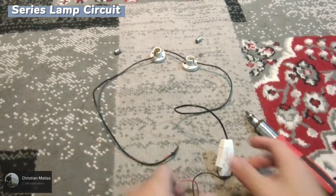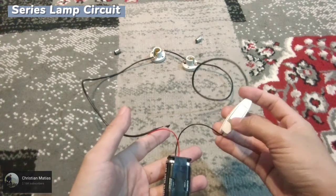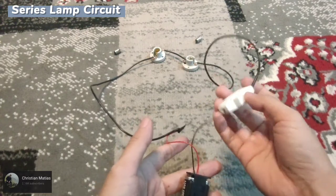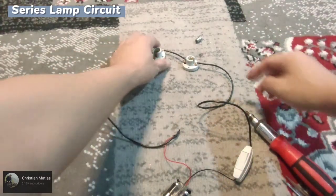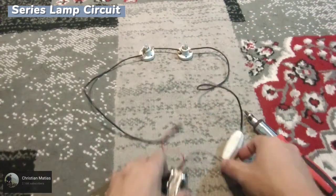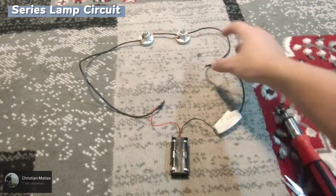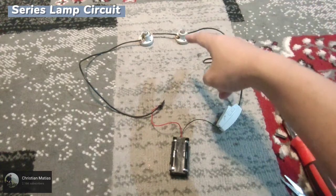All right, so we're done. It will restrict the flow of electrons when you press the off button, and it will allow the electrons to flow if you turn on the on portion of the switch. So let's turn it off, and then we put back the lamp bulbs through their bulb holders. So this is your entire series circuit design using a switch. You have the loads here, your bulbs there, the connecting wires, and the switch to restrict and allow the electrons to flow to make your bulbs function.